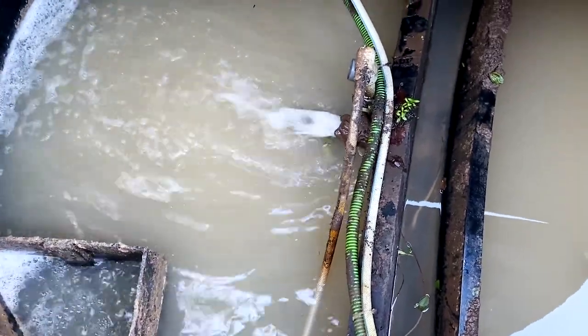We moved into this Victorian farmhouse a couple of years ago. The previous owners had renovated it and put in a home sewage treatment plant. It's called a Vortex, and it's quite important to make the distinction that it is a home sewage treatment plant and not a septic tank — it's completely different. It uses technology to pump air bubbles through the system, which allows bacteria to flourish and break down waste matter inside the tank. Because of the aeration, it kind of tends to look after itself and is a more sustainable option.